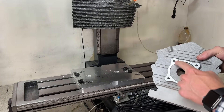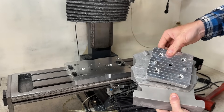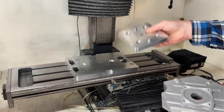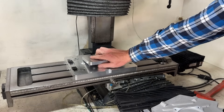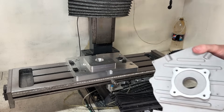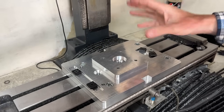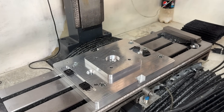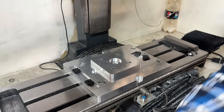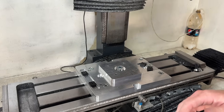Once Op1 is completed, we're left with these four holes. We have a subplate which actually bolts up to these four holes, and the holes are countersunk to recess the fasteners. From there we can place this on the doweled surface and have the part in multiple orientations. It makes more sense when we have this mounted to an angle plate so we can actually machine every face on the engine. This is an absolutely perfect transition fit with no play, secured with a single M10 fastener in the center, making removing the subplates extremely easy.